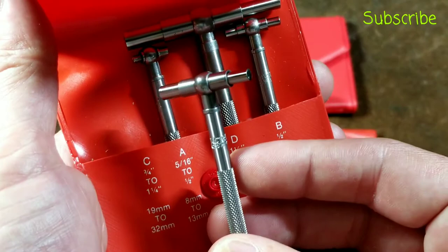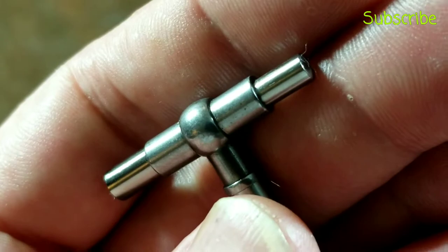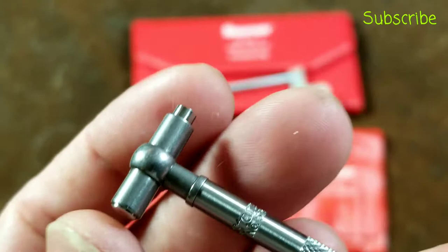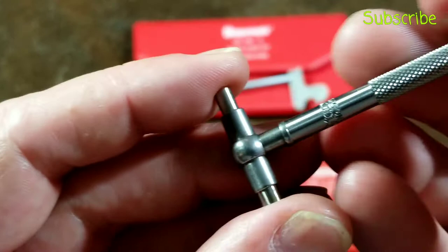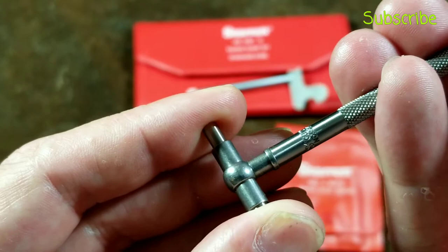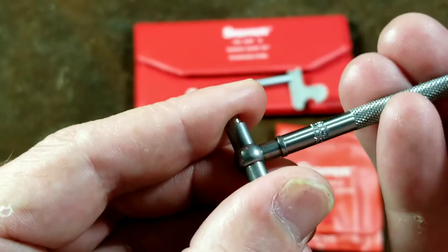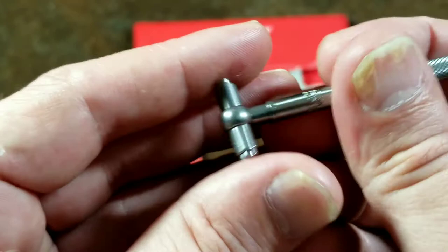How these work is they're telescoping — they just have two anvils, little tubes that slide inside each other. There's a little pin that will lock them down once you get them in position, and that provides your measurement. The trick with these is that you actually have to have just a little bit of friction on them. You're offset just a little, get a bit of friction, then tilt them when you do your measurement. The hardest part is getting just the right amount of tension so it pushes in with friction and then stays at the measurement, giving you the appropriate pressure on the anvils so you know you've got a solid measurement.